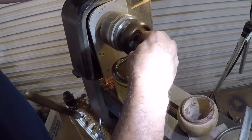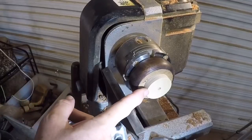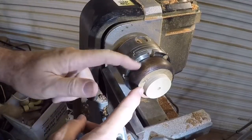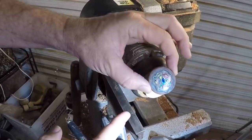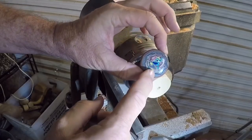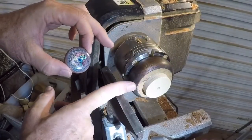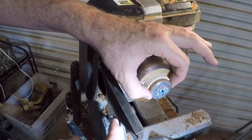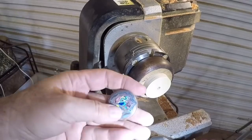So just a little polish here. This is a glue block I put on that I can use as a tenon to turn the small piece. I'm going to quickly turn that off and shape the top. I've got a medallion from the Cadillac Ranch paint and I'm going to use it as an inset. I'll take this to the shape I want, cut the inset, get this thing stained and ready to receive it.